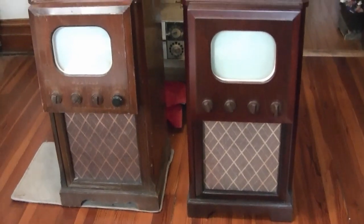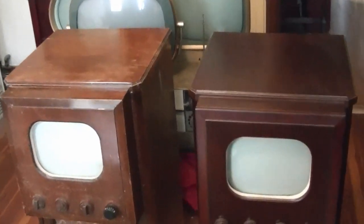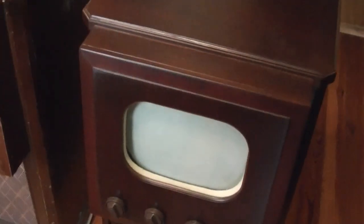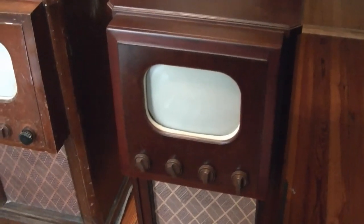Here are my two Admiral 3812s side by side. Obviously the one I refinished is on the right. Not only is the refinished one darker, it's a different kind of brown. I think I used mostly dark walnut and some perfect brown, because I was running out of toners as I was doing this — so for example, this area is a slightly different color than that. But now I've got a reference to go off of, and lacquer is very easy to get off. A little steel wool, acetone, lacquer thinner — 20 minutes or so and I could have that whole thing stripped down again.